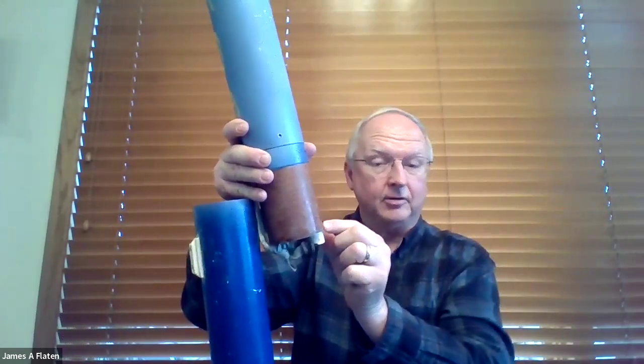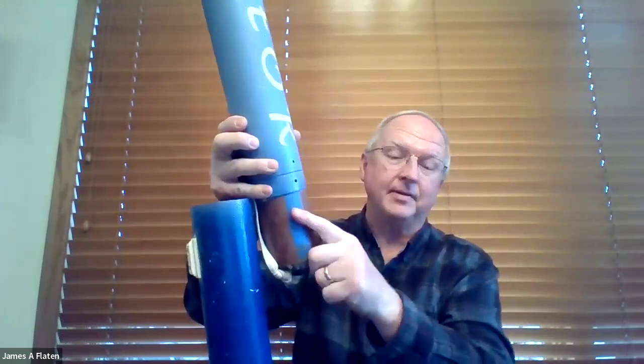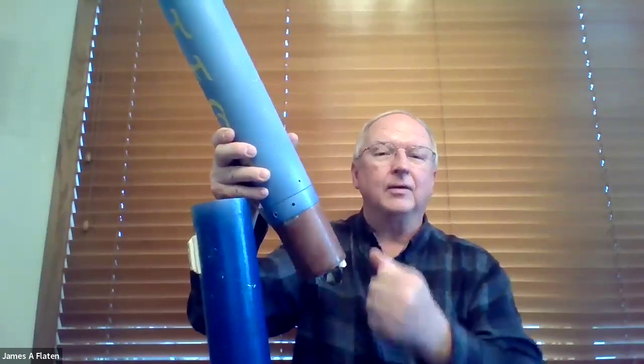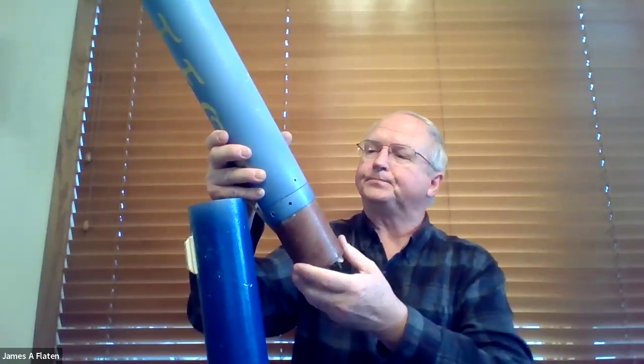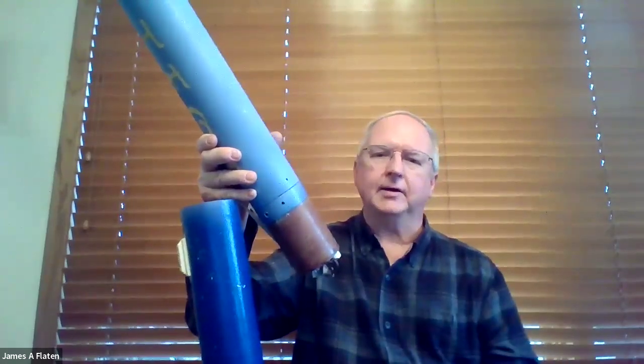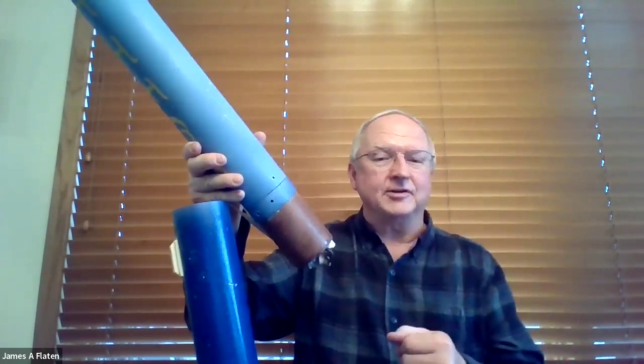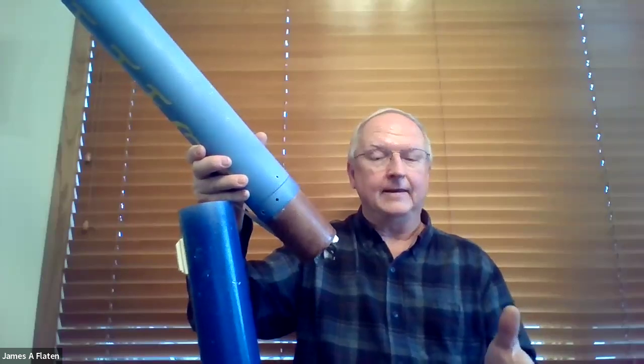If it's too loose and falls off, you can put tape on it. My recommendation for taping a friction fit is that you put your tape vertically - one layer of tape vertically right here, and then try it again. If that doesn't work, maybe go 180 degrees. There is some tape on there already vertically. If it's still too loose, put some more tape on vertically and add thickness, perhaps in just two spots, until it feels reasonably tight. It can come apart but doesn't want to just fall apart on you. When you go outside to launch a rocket, the weather will be different than where you were when you built the rocket inside. The best you can do is get the rocket ready with a reasonable friction fit indoors, then double check when you get outdoors. If it's too tight and you can't get it apart, you'll need sandpaper. Bring tape along to make it tighter, bring sandpaper along to make it looser, and set it up as best you can indoors, then check and adjust it when you're outdoors.